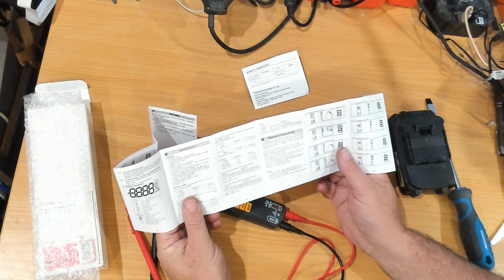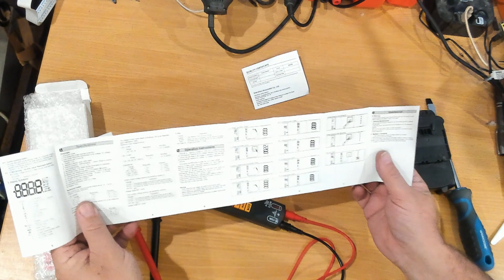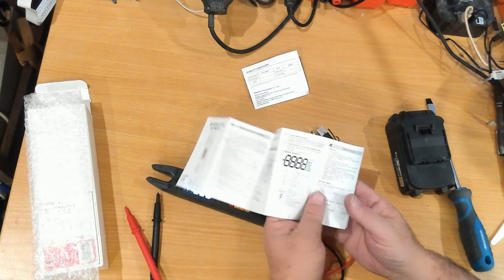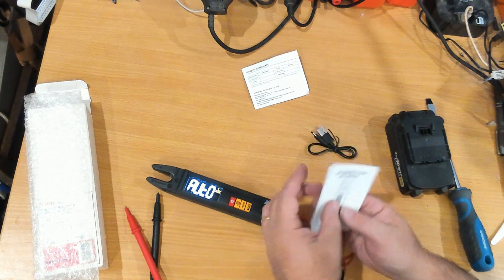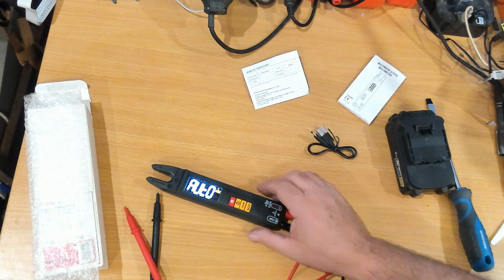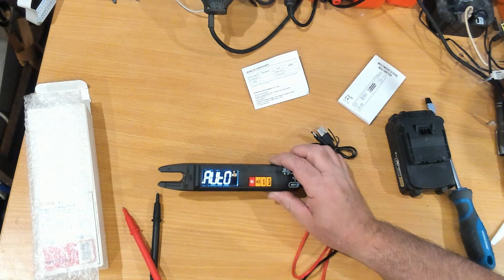The manual is pretty comprehensive on how it works. I did try it with a capacitor — it initially measured about 1V, which must have been a residual charge. After I shorted that out, it then showed increasing resistance, which is indicative of a capacitor charging behaviour. I'll do some more testing on this and get back to you.